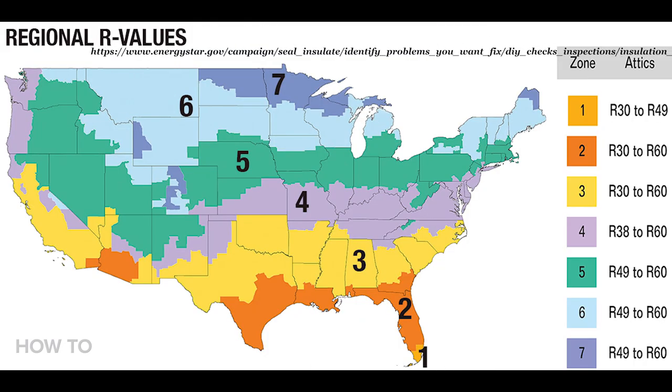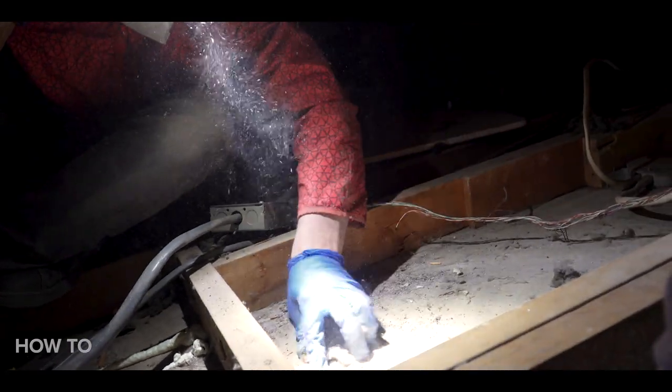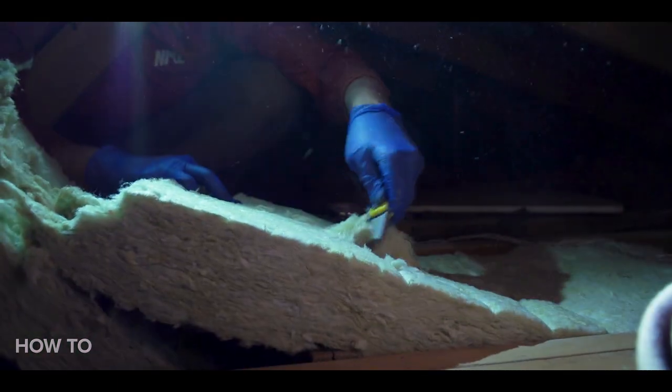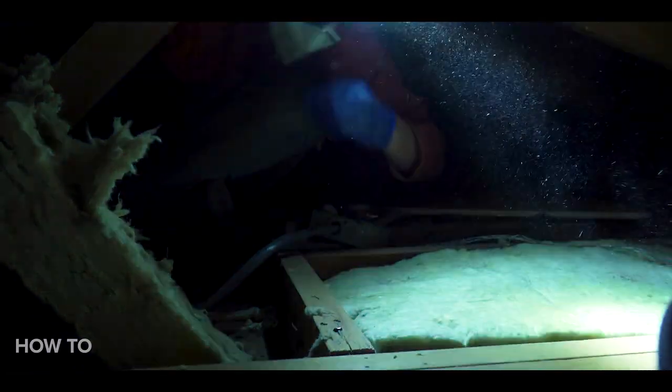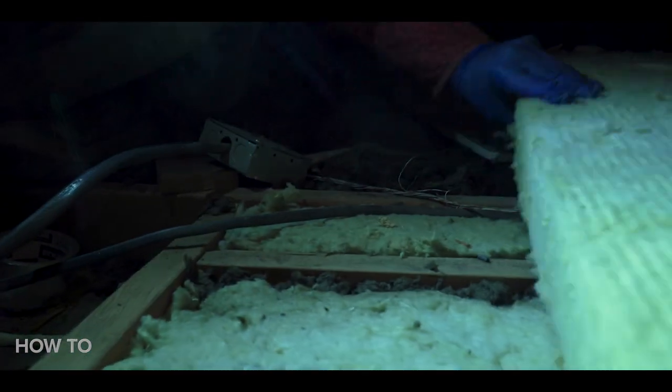The first layer needs to be as thick as necessary, depending on the ENERGY STAR recommended R-value of your geographical location. When insulating your attic, make sure you're wearing protective equipment and cover your skin, eyes, nose, and mouth to avoid breathing in fiberglass or dust or getting it on your skin. First, clean out the joist bay so the insulation can lay completely flat. Then put a batt of insulation in the bay and cut the length so it fits snugly. We had some leftover blown insulation that we used to fill some of the gaps. Then add the second batt layer perpendicular over the joist so that the wood is also insulated and not just the bay.